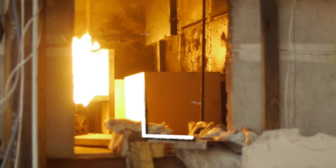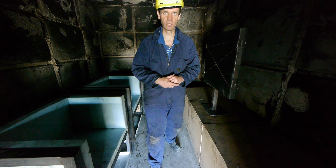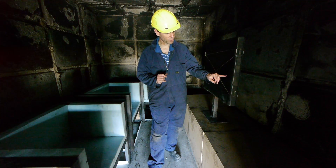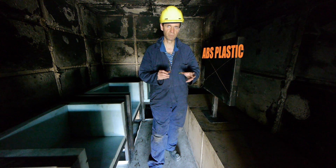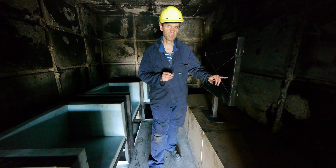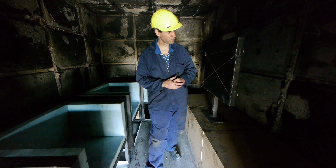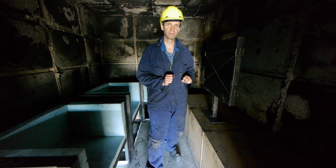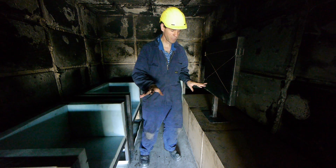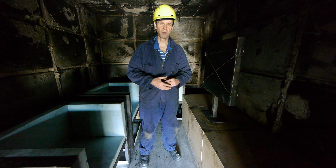We've made a 600mm cube here, which isn't a typical item but is easy to repeat consistently for research purposes. The third material is ABS plastic, used in TVs, computer monitors and similar items. It's quite a combustible material and contributes significantly to the fire load in a building. We're replicating flat screen TVs — two sheets of ABS plastic within a steel frame — which is easy to repeat across experiments. So these three materials represent typical combustible contents in a room where a fire might break out.